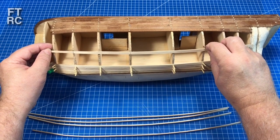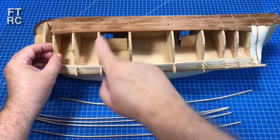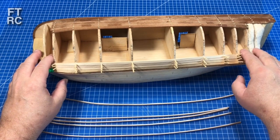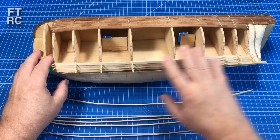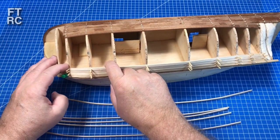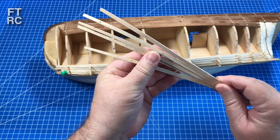With that plank set and my points marked at 45 millimeters, I could then measure all the way through. The table told me that for the bottom section, every one of these stern planks in the lower section was at least five millimeters or greater — so there was no tapering needed at all. With my forward planks, they were all fine until I got to this rib, where I needed four millimeters, and this rib I needed five — quite a drop.